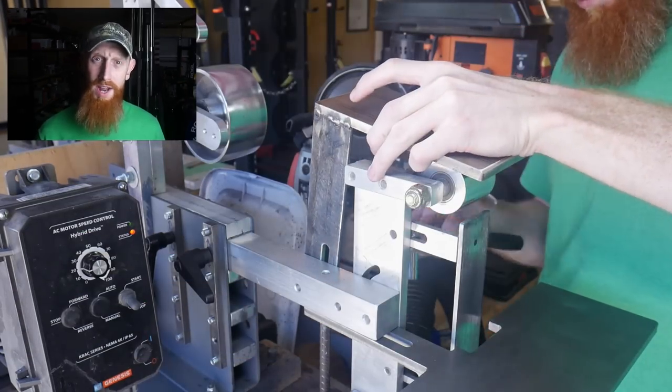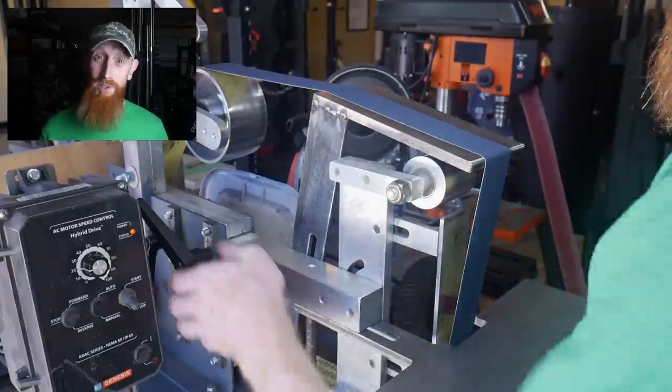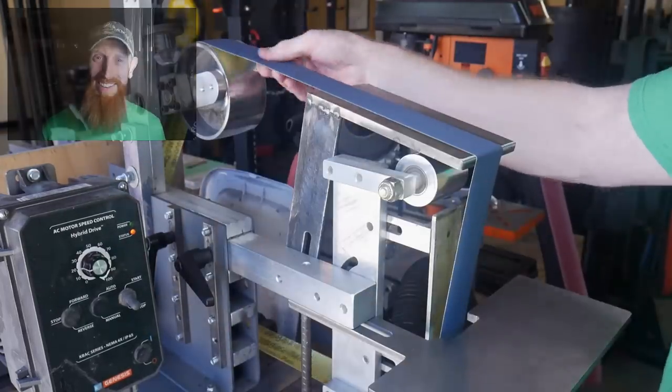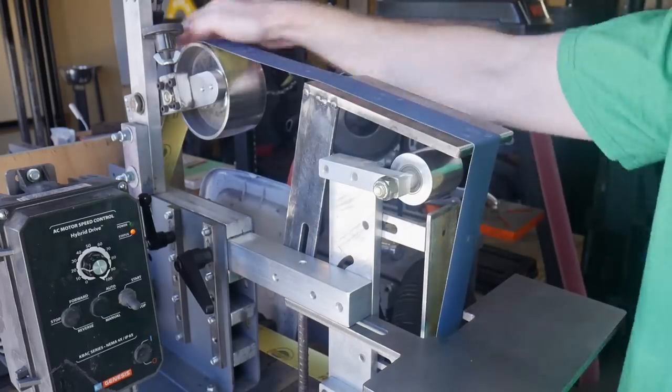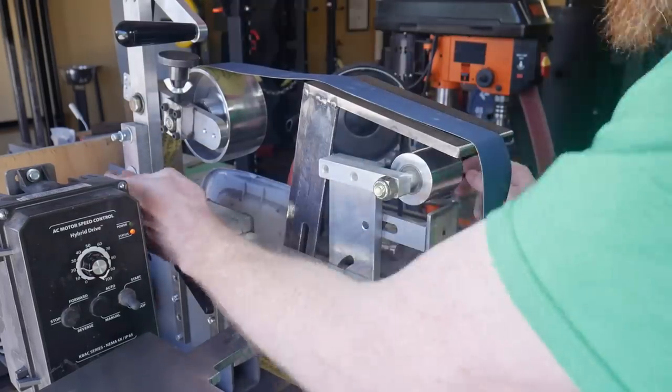The grinding and bevels of this knife went really well — very lined up, very symmetrical, and I'm pretty proud of them. However, if you put a straight edge on them they're not 100% straight on both sides at the plunge line. So I'm going to try out a method that I saw Kyle Royer use: creating a top platen on the grinder and attaching a file guide to the knife to get both sides perfectly straight and symmetrical. We'll either end with perfectly symmetrical plunges or completely jack up this knife — we're about to find out.